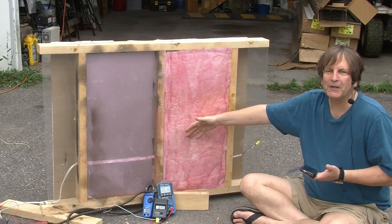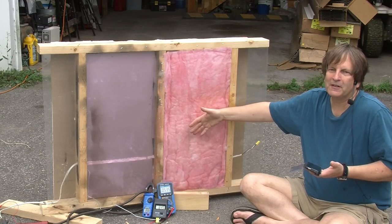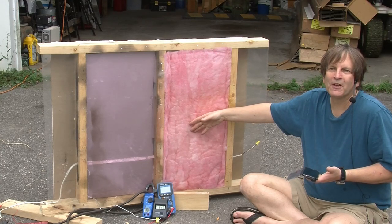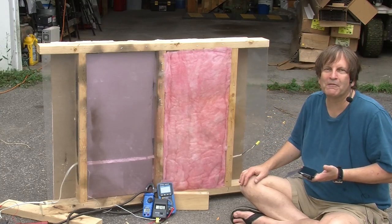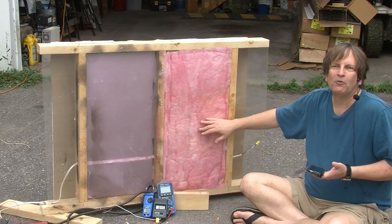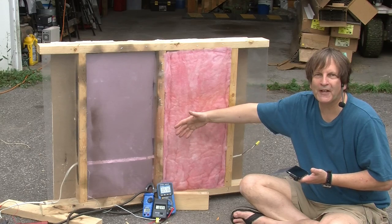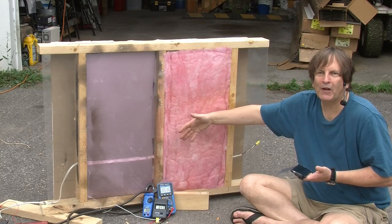The newer wires have a maximum temperature of 90°C, so certainly if this was an older piece of wire, this would already be a bad situation. Bear in mind the outside temperature is 30°C — about 80°F. If you had this in an attic in the summer where the temperature might already be 50°C, you add 30 more Celsius from the wire's heating and you're at 80°C, which is close to the 90-degree limit. This really shows that in a worst-case scenario we don't have much headroom for over-currents. That's because the insulation is doing its job — keeping heat near the wire.